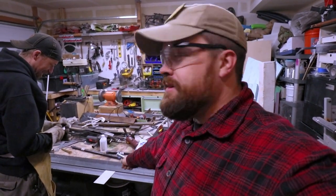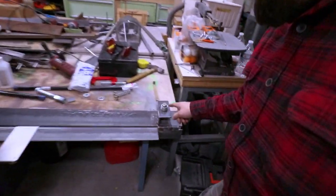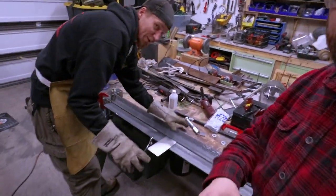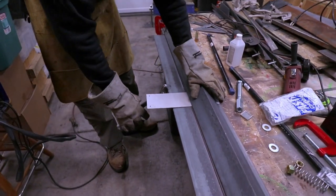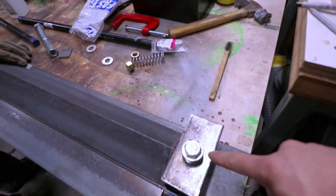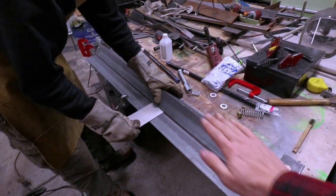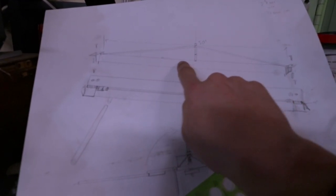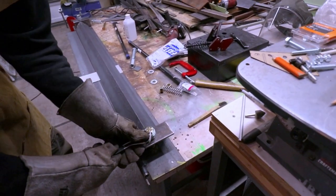Before I knew it, Danny's got a piece of metal in the bending device - in the metal brake that we just built. We've got our bolts on that are holding the biting edge down. Okay, let's see this thing work. I am sacrificing a piece of metal - nice aluminum. Look at that - you can't even bite that. It's too thin. I didn't clamp it down very tight. We don't have our strut support yet. We've done most of this brake but we haven't completed our middle strut system that pushes down in the center. That is most likely why that piece of metal is floating. Because as soon as I get over here it gets tighter.